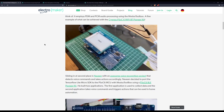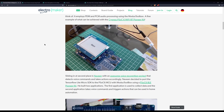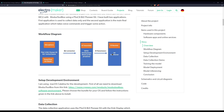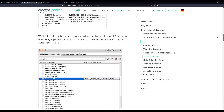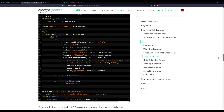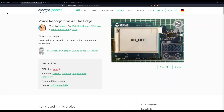In second place, Naveen used the Bluetooth Low Energy Kit with the e-ink display for voice recognition, and ported the TensorFlow Lite micro SDK to do so. The microphone picks up voice and was also used to collect voice samples to train a TensorFlow Lite model using Edge Impulse. TensorFlow Lite uses inference to work out commands, sending them via BLE to an ESP32 board which then controls an air conditioner or whatever you want. The project page walks through everything, including setting up Modus Toolbox, the Eclipse IDE for Cypress PSOC6, and how to train the model. A truly fantastic and very deserving second place.